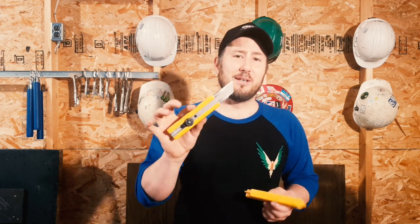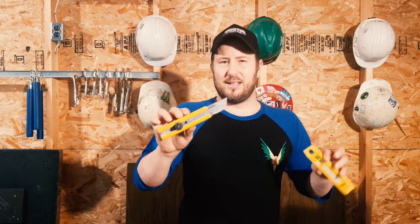You need to get a 25 millimeter Olfa knife — your utility knife, whatever you want to call it. The 25 millimeter Olfa is the way to go. It can cut insulation, it can cut drywall, and it cuts nice straight drywall because the blades are strong. If you buy the small Olfa knife with the skinny slim blades, the lines aren't as straight. Plus you can do a lot more with this — you can carve your 45s easily, it cuts insulation like nothing.